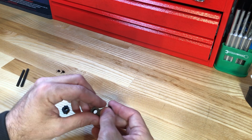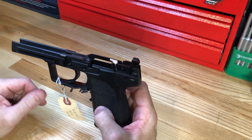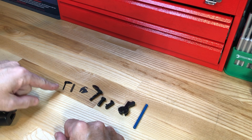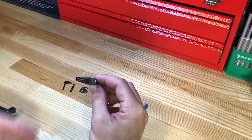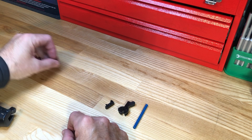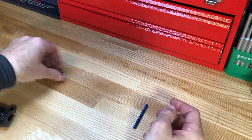I've installed the LEM conversion kit into this USP receiver. What you're left with are the parts you no longer need once you've done that conversion: your slide plate, slide plate spring, and detent plate — all three of which allow the safety lever and decocker lever to operate. Since it's double action only, I don't need those anymore. There's a different axle for the selector lever, a different sear for double action only, and we've already talked about the original spurred hammer — for double action only you don't need that or the original hammer spring. The LEM hammer spring is a different weight and a different color.